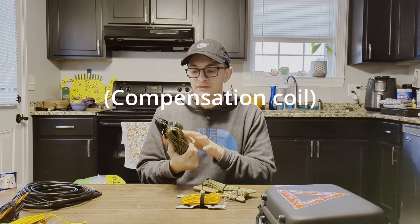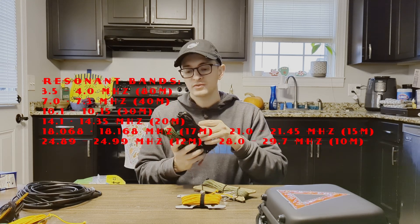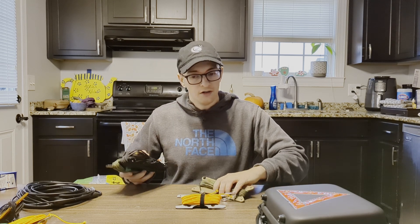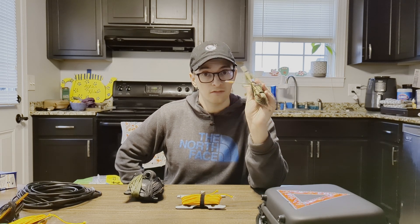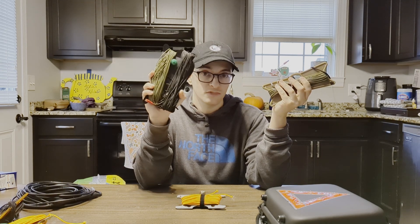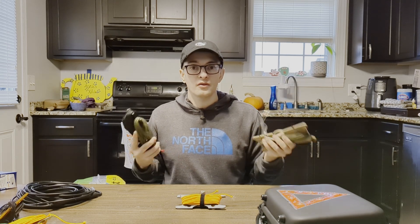There's a tap on the antenna that makes some of the other bands resonant. It comes with an SO-239 connector with a protector on top of it, and also what Chameleon calls Type 90 paracord. It also comes with an addition of what I believe is a 67-foot copper-clad Kevlar wire, and this will make the antenna work on 80 meters. So if you only do 20 or 40, you have the option to just take the main element, and if you want 80 meters, you can take this extension too. I kind of like the fact that this is modular.